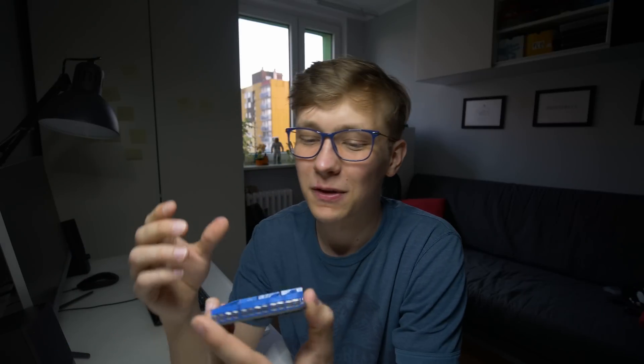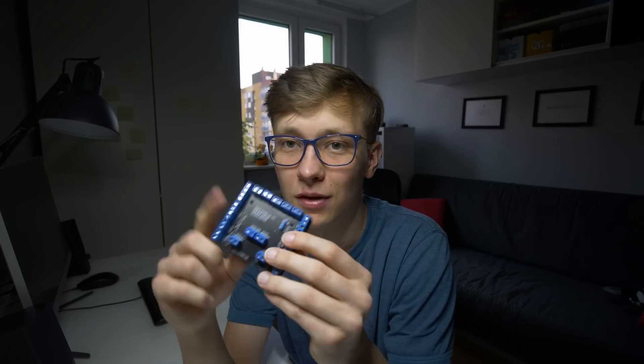Soldering that was 100% fun — like 30 minutes of just playing with the soldering iron. On a scale of soldering difficulty, this project was right in the sweet spot: not so few components that you can't enjoy the process, and not hundreds of tiny SMD components that are stressful to solder. Only THT components — even a total beginner can solder something like this without any problems. One thing though: I told you to start with screw terminals first — well, it's not a good idea. I had to maneuver a lot with the soldering iron to solder the gold pins afterward. So definitely start with the gold pins, then move on to screw terminals.